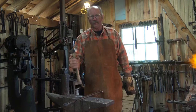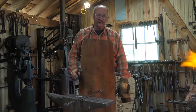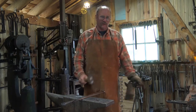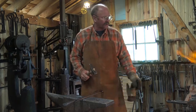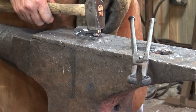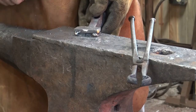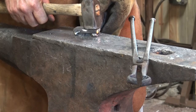We're going to weld this with about a two-pound hammer. You want light, rapid blows right away — you're not trying to kill it, you're trying to get it to weld. As soon as it starts to cool off, get back in the fire. There's no reason to keep working on it if it's not welding — don't keep working on it. That's welding heat. We're going to take several heats and work very methodically, starting right at the edge — about six blows across the edge. You can tell by the right consistency and plasticity of the metal whether it's welding well.